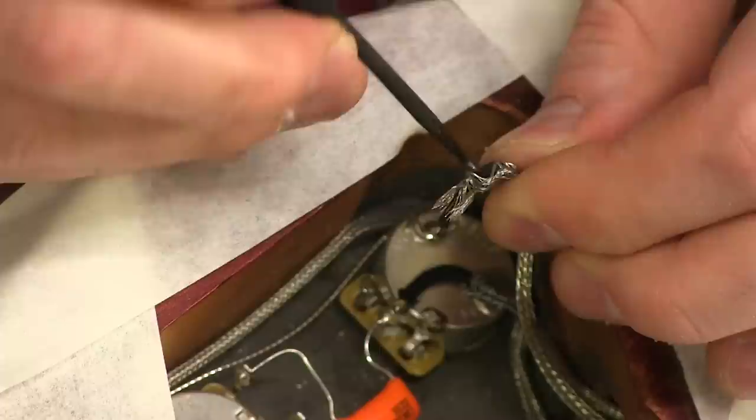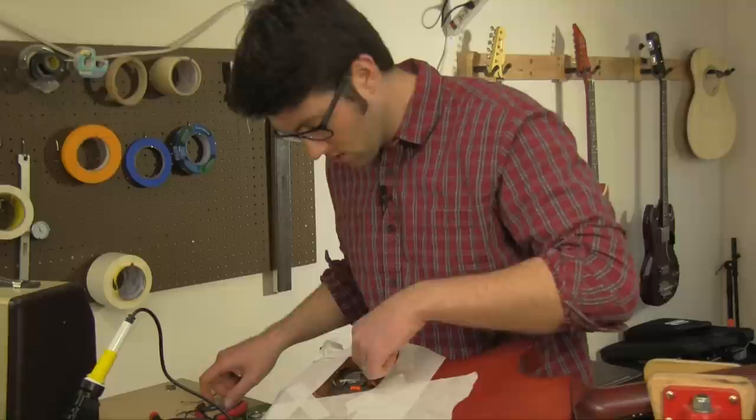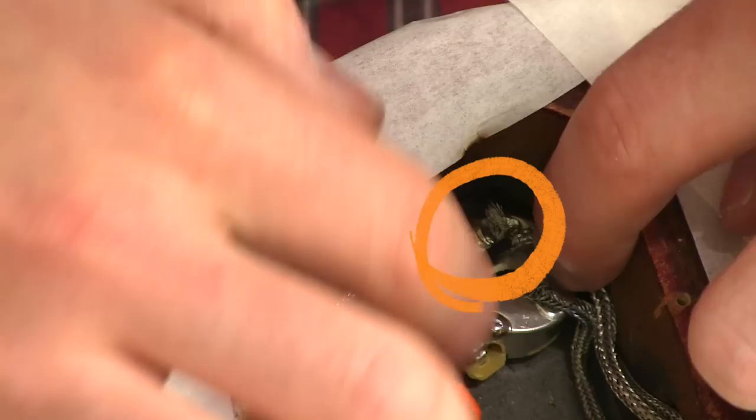Now I've separated these out. There's a couple ways I could go with this. One would be to just trim this here so there's no separate wire at all. Another way — a tip I got from Eric Coleman — is to trim this short so there's a little bit of a tail, and that gives me a nice little flat shielded wire that's easier to solder to the back of a pot, so I don't have to get as much solder on there.